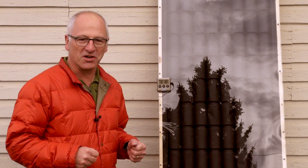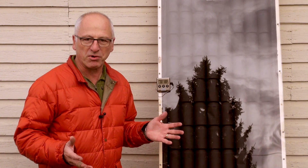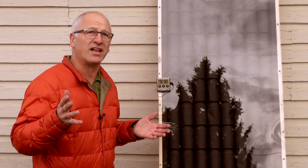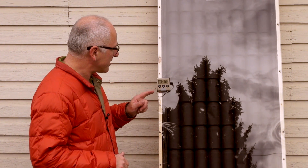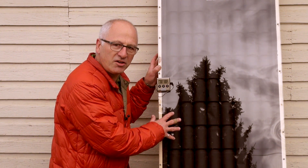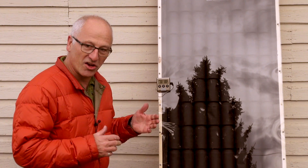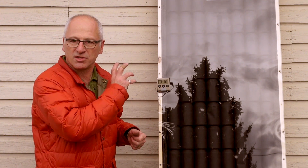Here with our finished solar air heater — our homemade solar air heater with less than $100 worth of materials. It took us only about three or four hours to put it together, and that's without knowing what we were doing. We're out here on a cloudy day in Edmonton, Alberta — way up north. The ambient air temperature is about 10 degrees Celsius, and this, just sitting here with the clouds out and the sun barely filtering through, is already up to 26 degrees Celsius. From what I've seen online, these units can get as hot as 140 degrees Fahrenheit, or about 60 degrees Celsius. So that's going to provide Yarrow a lot of heat in his garage. This simple little system is going to work and it's mostly passive, except for the little fan that moves the air around.